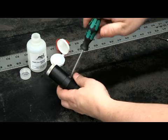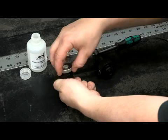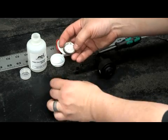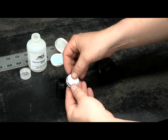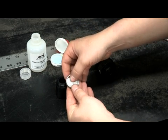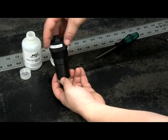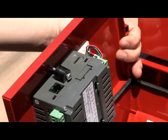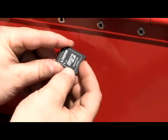Part of the routine maintenance for the i-Series is occasionally recalibrating the unit's analyzer filter about every two to three weeks on average, depending on water quality. Replacing the probe membrane and electrolyte about every three months on average, again depending on water quality. Cleaning the sampling valve screen filter as needed. Remove the micro SD card to mainly retrieve data and information from the site.